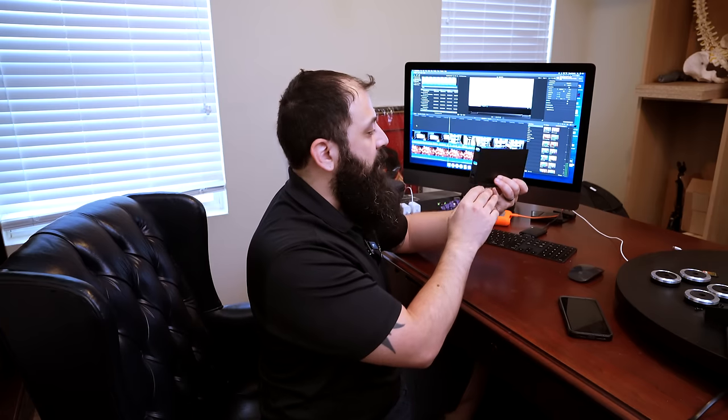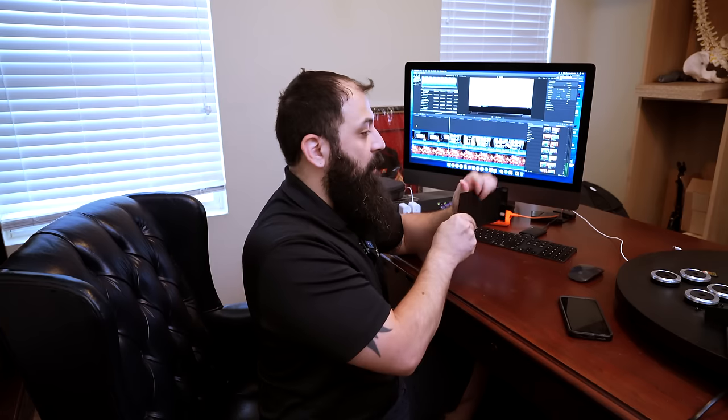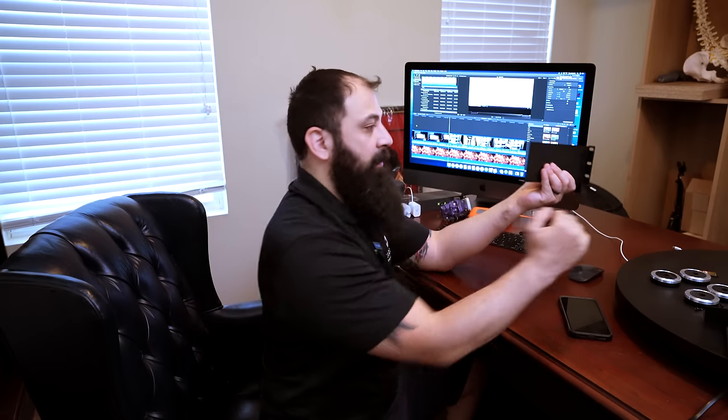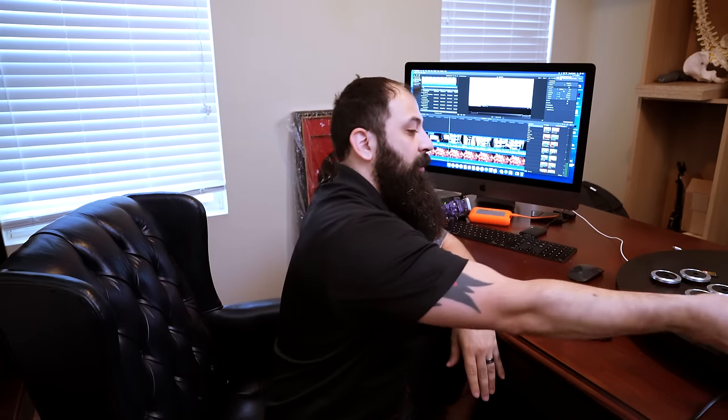So what you do is you put these on the backside. So whenever you're gonna put something in there, say you put something on 17 here and you line it up 17 on the bottom there, screw this in on the back, both sides. And then you basically just rest it on there and then just lift up a little bit so you're not carrying the full weight of it. And then you can go ahead and cinch it in on the rack ears. So that's another little pro tip like that.